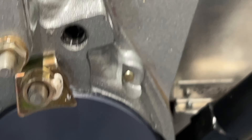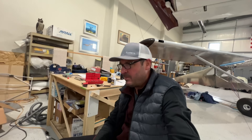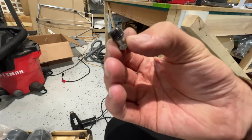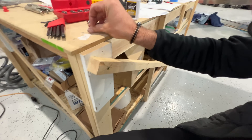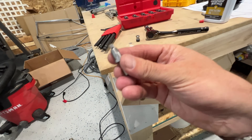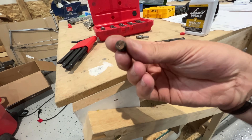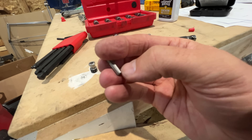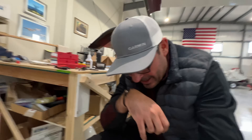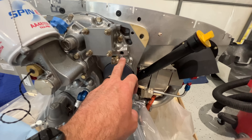Oh my god, I got no sleep last night. Thank you Steve and Bobby — this little guy saved the day! So the answer, for me, was using this new set — power extractors. There's a larger size that would be good if you can drill through deeper into the bolt, but since I didn't want to drill through and introduce shavings into the case, I just unscrewed the bit all the way down and used only the extractor portion. I'm going to clean that out really well and then put in the fittings for oil pressure and manifold pressure — then it's hang time!